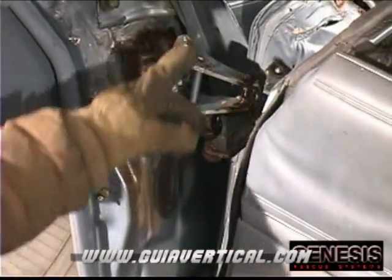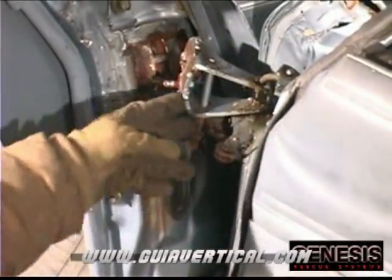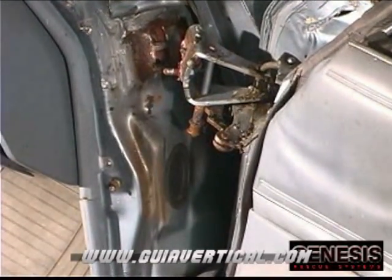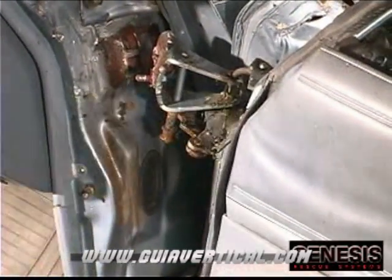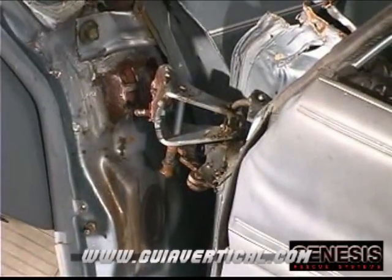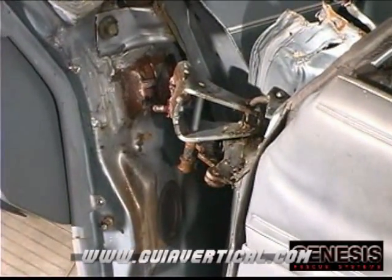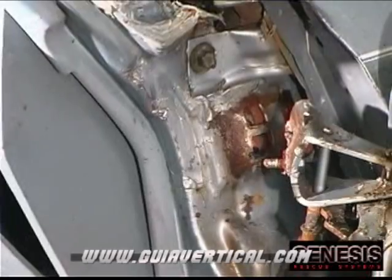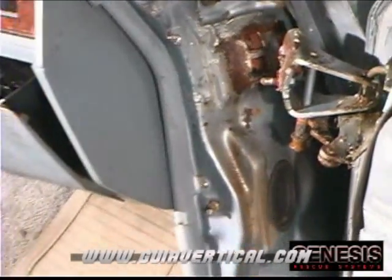The reason for that is I've got a center pin on each side of the hinge, and a lot of times when your spreader gets in there, you get all the force of the spreader going on those two pins, and it'll want to start riding out on you, start kicking out. So that's my last option. The bolt heads, another point where we've got to be careful because those are usually hardened steel, and that's a very hard place for a spreader to move.